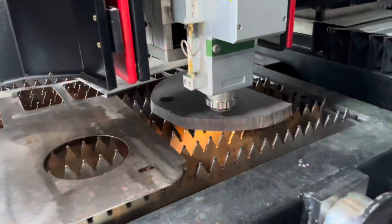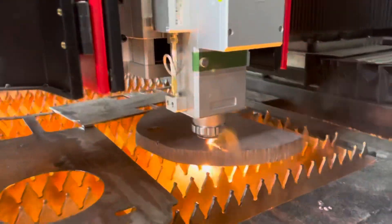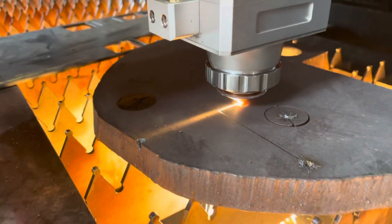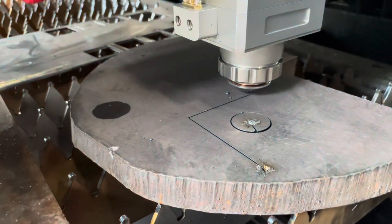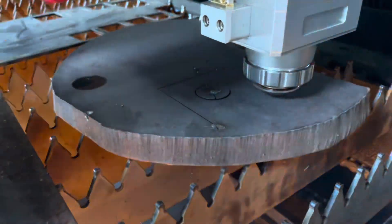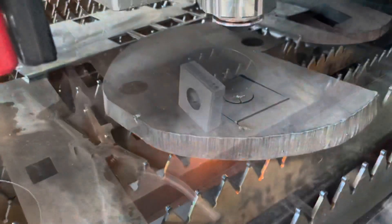If you're going to do production cutting, you need that extra overhead because once the plate heats up you're going to need it. You can see it's cutting very, very slow, but we do get a nice result. This one was set up with a ring cut configuration to allow the corners — one of the issues with cutting sharp corners with thick steel with oxygen is it'll eat away the corners. The ring cutting allows a chance for a little bit of cooling.